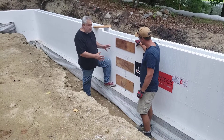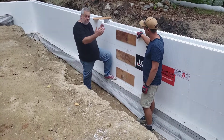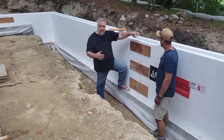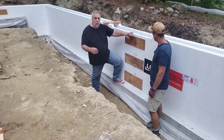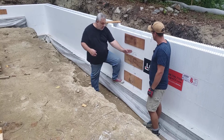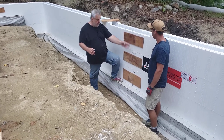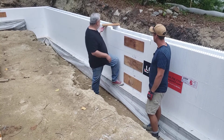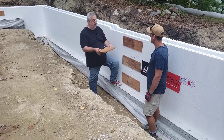Over here at this section, they built in from the corners, and what that does is it gives you that oddball dimension in the middle of the wall. They inevitably end up cutting in this vertical seam, and the way you solve that is with a simple plywood gusset plate.